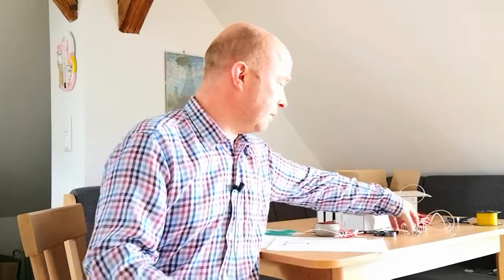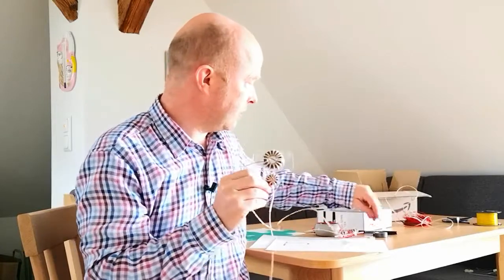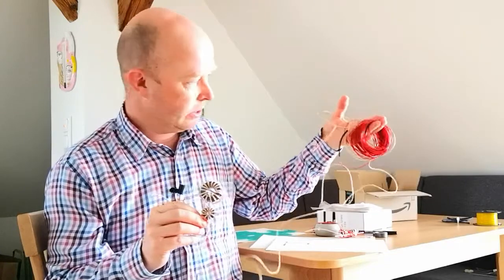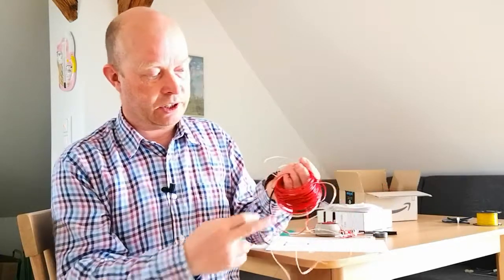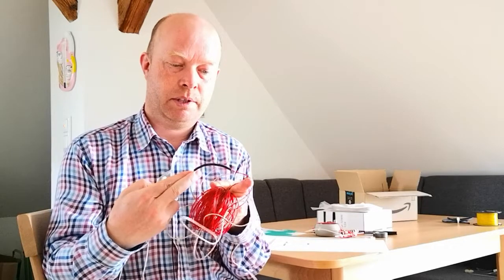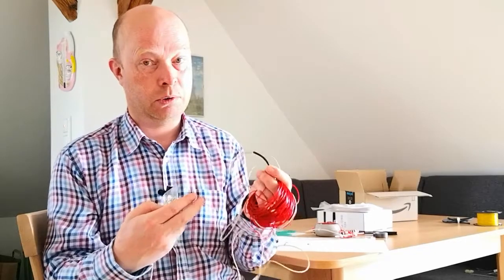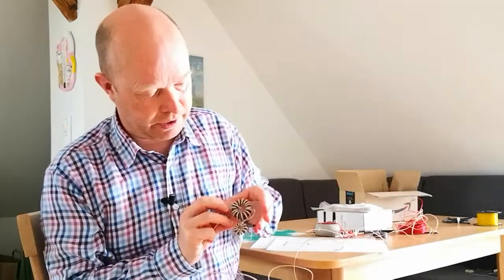The first ones I made, when I started out making them, were quite big. And so here's the first one. You can see here's the long leg of the wire. It's in a bit of a mess, but there's the coax. So this is the coax leg as it moves out until it reaches the feed point, which is here, where it suddenly transfers to the wire. And I've got a bit of adhesive lined heat shrink tubing here just to hold it. So that's what it kind of looks like, and you can see I've got two ferrites here.